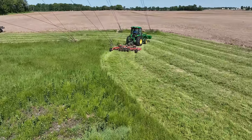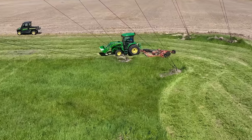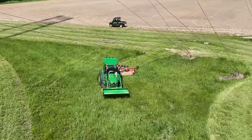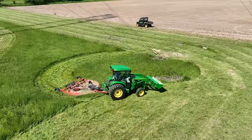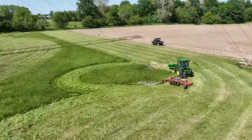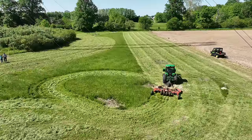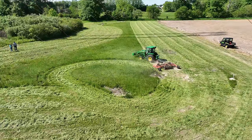This is much faster than I can mow with the 5075E because with the 5E I have to go slower for obstacles. I can slow down with the hydrostatic transmission, but with the 5E I would just run in a lower gear to avoid going too fast. You choose a good average speed, and when you're in easy mowing you're going slower than you'd like, but when you're around obstacles you're at a manageable speed. Whereas with the hydrostat, you can do that really efficiently. It makes it so much handier and easier on the operator — you can adjust to whatever the conditions are immediately without worrying about changing gears.